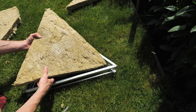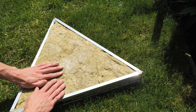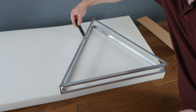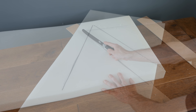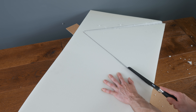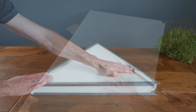Now, cutting insulation with scissors is easy enough, allowing it to fit snugly inside the frames as shown here. The sponge is a different story, however, as it's difficult to use scissors to cut it down. So instead, after marking the shape out with a pen, carefully use a bread knife in one direction to cut through it, as this is quick and easy to do, and results in a nice clean edge.